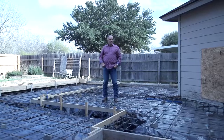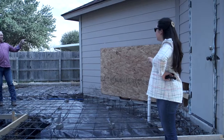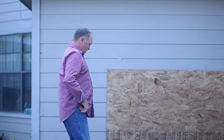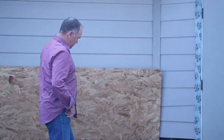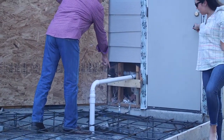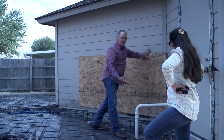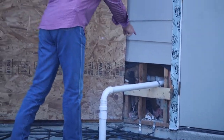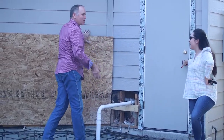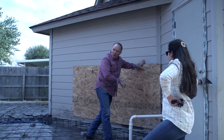So what's this? This is going to be walls removed. The plywood — yeah, that's because we had to access the plumbing here. As you can see, something kind of unusual here: we had to tie into a drain to be able to access it from the new addition, but we still need the existing sink to work while we attach to it. So after we pour, we can cut this off whenever it's time — the sink will keep running in the meantime. This is something you only have to do in remodeling.